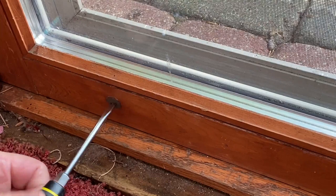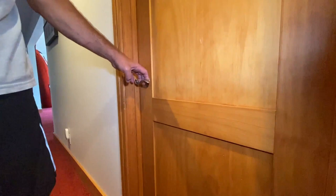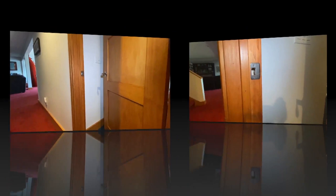People ask me this all the time — make sure the track is clean, of course, but don't ever put oil there. This is another one: a door that you close and it doesn't latch. You can just push it open. Over time, doors can sag. Houses move all the time, so there are a couple of fixes. First, you want to look at the strike, and you can see on this one a little line right there where it's rubbing, which means I need to adjust it.